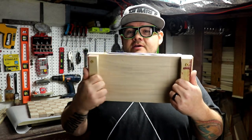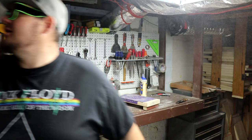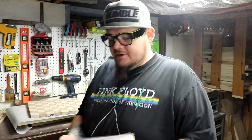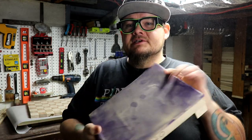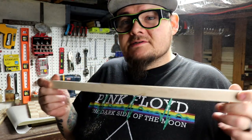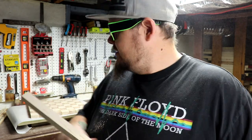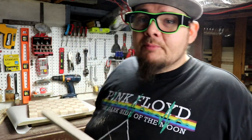I'm gonna go ahead and get ready to start sanding. We're going to use these sanding sleds that I've made — I have two of them, one is 80 grit and one is 120 grit. It's just a piece of wood with a couple of handles and a piece of sandpaper on it. Actually, you know what — I think we're gonna do the grooves on the frame pieces first and get those glued up with the inlays in them. That way, while those are drying we can be sanding the board, and by the time we're done sanding the frame pieces will be dry and we can get them on the board.